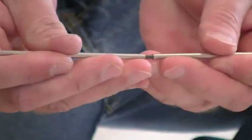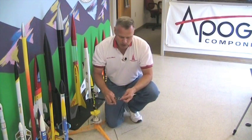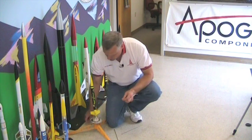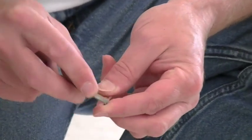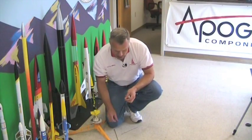Now if it doesn't start on yours, there's two tricks you can try. The first one is take a pair of pliers and squeeze that roll pin — it's split down the side, and if you can squeeze it gently, sometimes that's enough to get it started. You can also take sandpaper or a metal file like this and just kind of go over the edge, and just kind of round off that edge just enough so you can get it started in the hole.